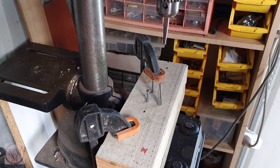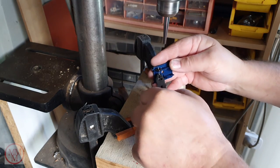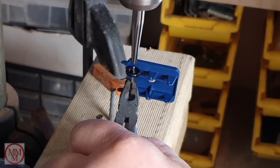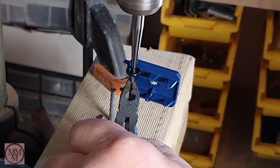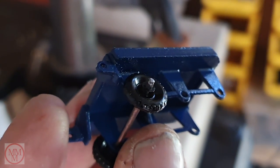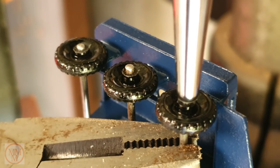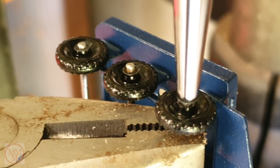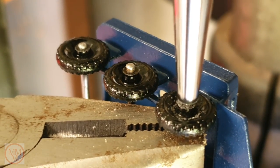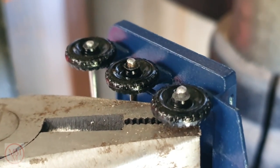After I've done that I've got to put the wheels on. So I've got here two nail punches with concave tips, put them in my drill press exactly aligned together, and using some gentle pressure at a moderate speed — not fast, not slow — the chuck's spinning at a moderate speed. It only needs a tiny little amount because the axles are such a close fit to the hole in the wheel. Here's a tip — I was trying to explain how you know when it's done, because you can't physically see the end. Can you see all those little iron filings coming off? When you see the iron filings starting to shed, you're pretty much there — that's the time to stop. If you don't see the iron filings you're wasting your time — well, in my experience. But that's my tip for the day.